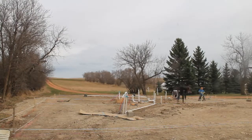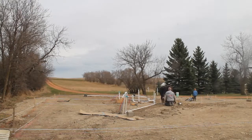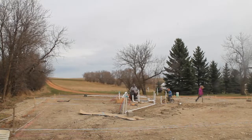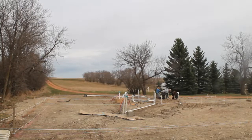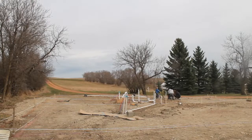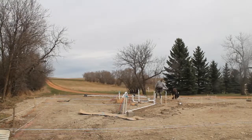You can see the cardboard layout in the bottom left corner was our template we made for our island to get a better idea of where we need the plumbing to be because it has a sink in it. We did a Chicago loop style venting system, which was a little tricky, and we had to keep digging deeper to get the drain pipe and the vent pipe both to work underground. All the plumbing took about 1 week to get it all finished and sloped properly.